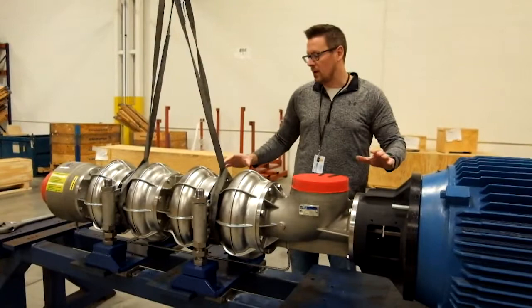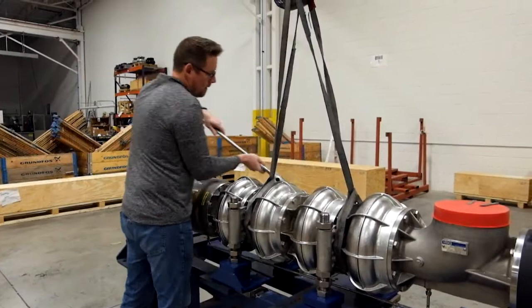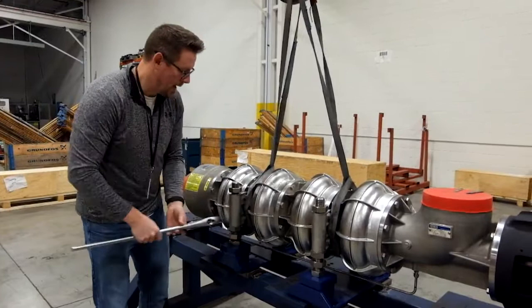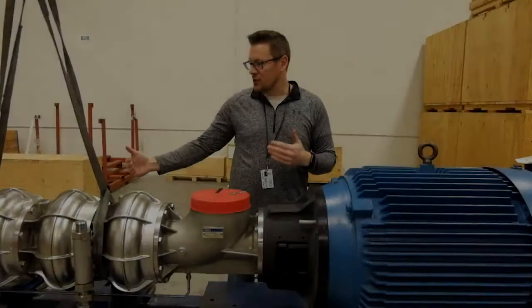It's best to leave it loose until you've got everything bolted up everywhere else, then tighten it last. Because I've got to raise the pump up, I'm going to loosen the top nut and back that off on both sides. Then, starting with the nut directly under the bracket, I'm going to raise that nut up, and the pump will be pushed up incrementally on each side so we don't cause the pump to rotate or twist.